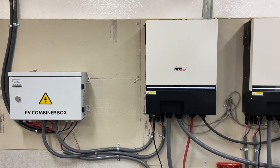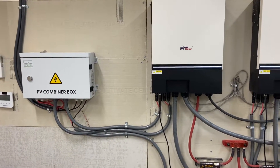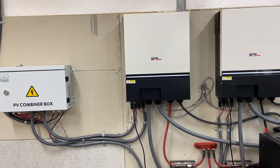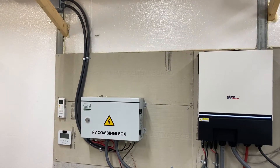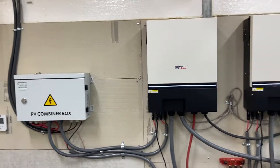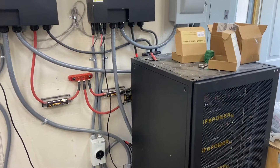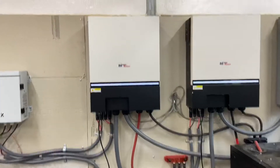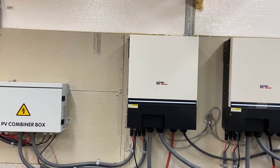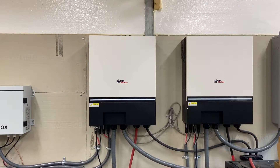These two units are each handling one phase, so people try to balance their solar wattage. My plan was to also get this next array up — it just ended up being two months later. Each phase is taking care of one leg of the 240. When it comes to the batteries, when you have a large inductive load startup like my well pump, the batteries take the first bit of the punch — that little bit of surge — and then the units take over from there in a split second.